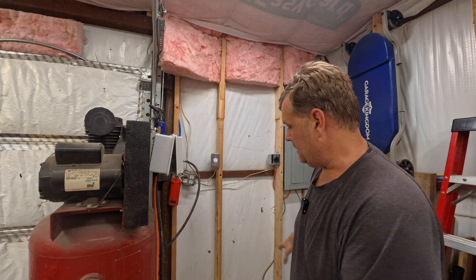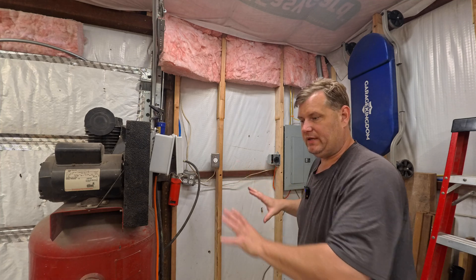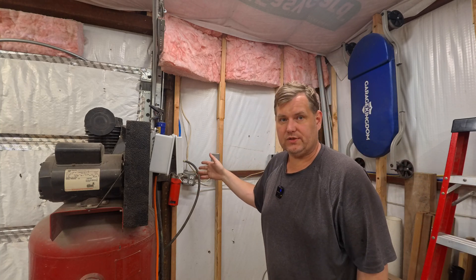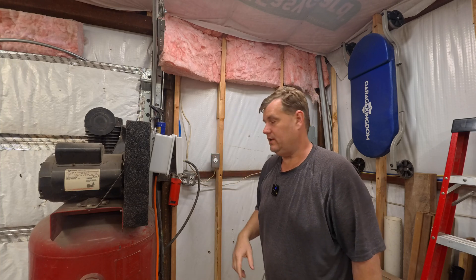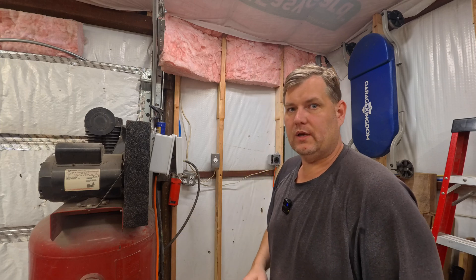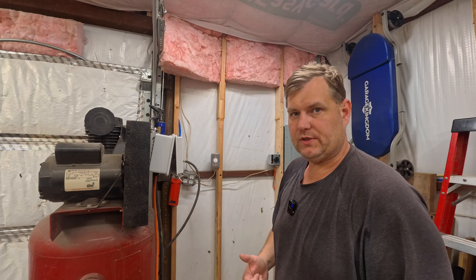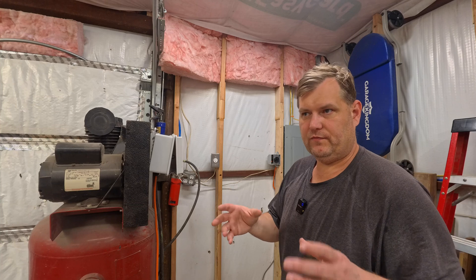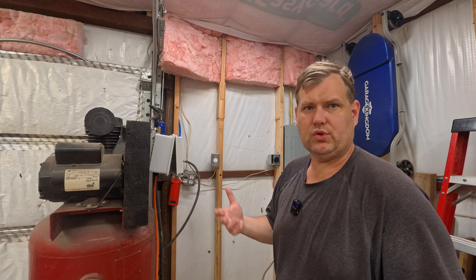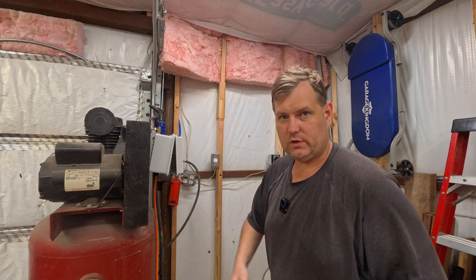So I said, hey, I'm going to yank it all out, clean it, get the two-by-fours and start neatening this up because this was a mess and a nightmare over here. The air system needs some more loving over here — I've got it going straight up out of there with no T, no drip tee. It's not really a good solution right now, and that filtration is way too small for what I really need. I used to have another one but it just leaked and it had to go. So that's on my list — I need new air filtration for my shop air. Something with good filtration, preferably with a desiccant in it as well, especially for a separate one for painting versus just running tools.